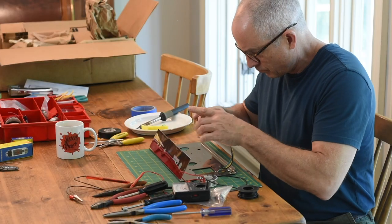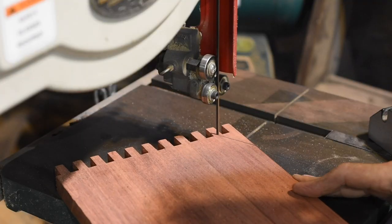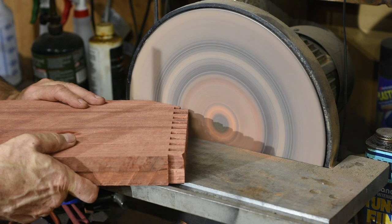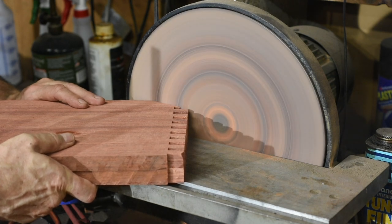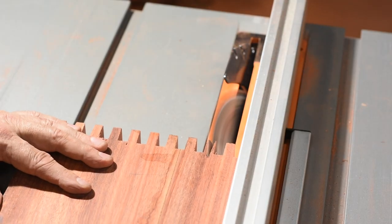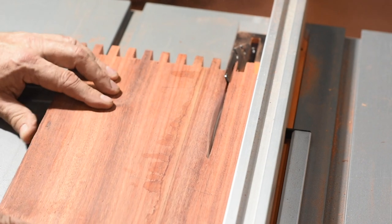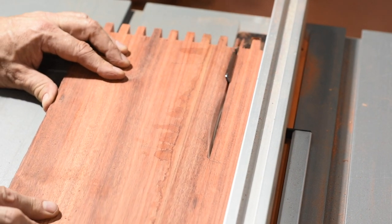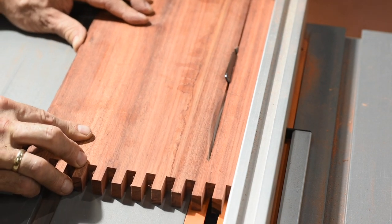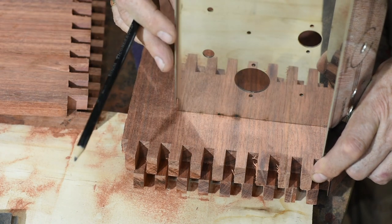The face of the GA5 chassis, like lots of combo amps, is beveled slightly — in this case, 30 degrees. So I measured everything, cut the two faces on my bandsaw, and then sawed the bevel into the cabinet top by setting my table saw at 30 degrees and ripping a new face. It also fits into a slot that needs to be sawed out before glue-up.